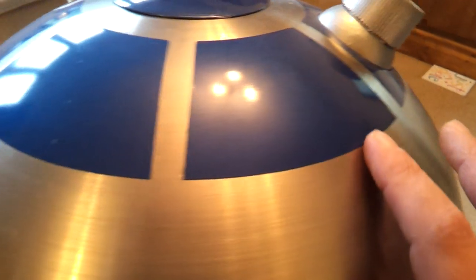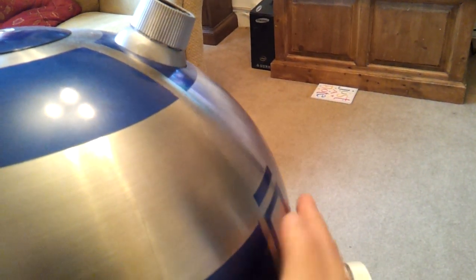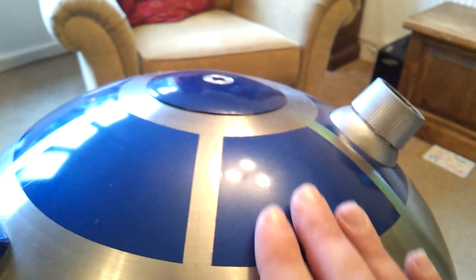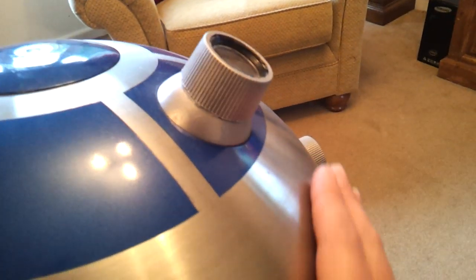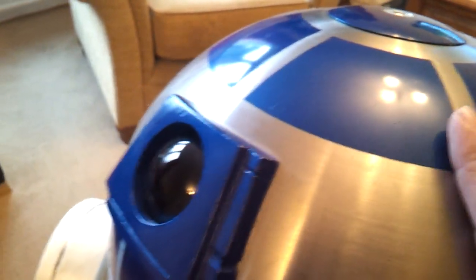You've got to make a special template cutter — basically a long stick with a razor blade on it, so you can cut circular pieces of tape, because you've got an angle going this way and that way. You need to be able to wrap it down. If you try to put straight tape on there, you can't really bend the tape around without getting a kink in it. I've got a blog — maybe Google 'autonomous R2-D2' where I explain about that and the bodywork.